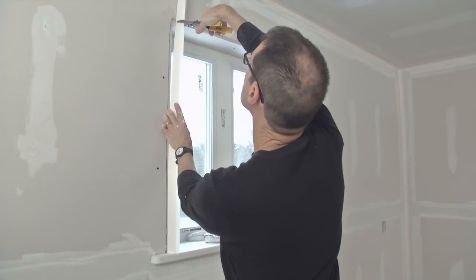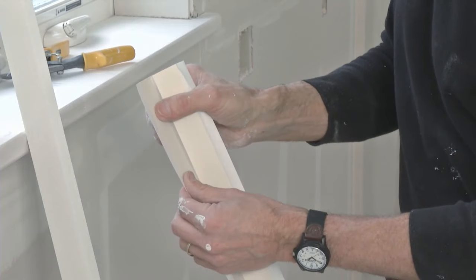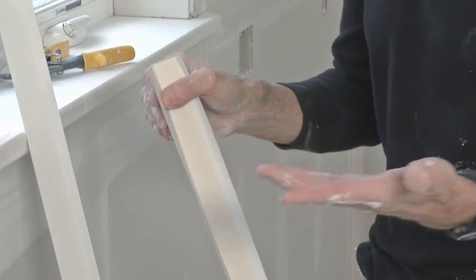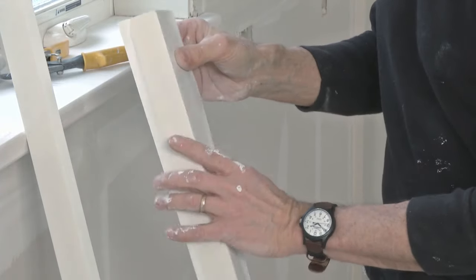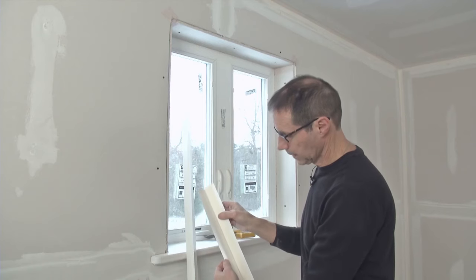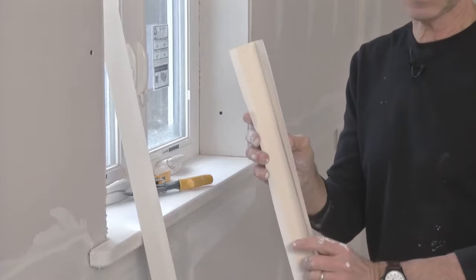This is not a metal bead with paper. It's actually like a vinyl bead that's coated with paper. So on the inside face, it's a coarse paper, very similar to paper tape that you put on a seam. And the outside edges has a finer, smoother paper that actually feathers into nothing as well. And that gets embedded nice and tight in the compound, just like paper tape does.